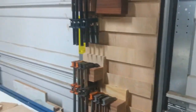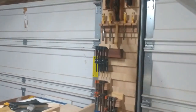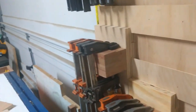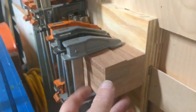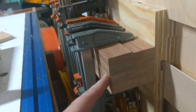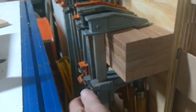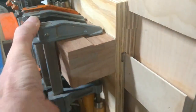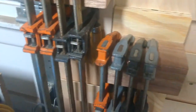I'm really starting to like the cleat wall instead of a bare tool wall with holders screwed directly to it. I'm going to be constantly changing what I want on these walls and where I want it, and I don't want to keep adding and subtracting holes. This is a work in progress. My idea for a clamp rack is basically just a piece of wood about two and a quarter inches tall with a little rabbet so it catches the head — that's all it does. Just put it here and squeeze it up and it's not going anywhere because of that rabbet.